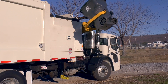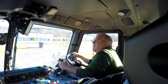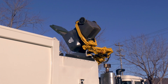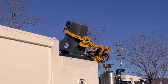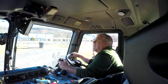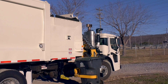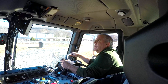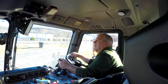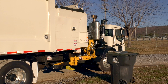Auto lift will move the lift arm up and then retract into the dump position. When in the dump position, release the push button. If you have stubborn refuse that won't come out, use the orange push button to initiate up to three can shakes; if more are needed, press and hold again for another sequence. You can release the button at any point to stop the can shake. When the refuse has finished falling into the hopper, push the joystick forward to undump and lower the can back to the ground. After the can is fully lowered, move the joystick right to extend the lift arm out, then press and hold the grabber open push button to fully release the can and initiate auto home. The lift arm will move back to the work position and you're ready for your next pick.